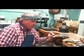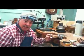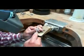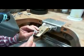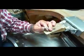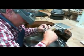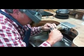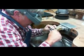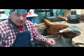Alright, now that our prongs are pushed over the diamond and holding it tightly in place, we have to do our final filing and polishing on the ring. First thing I'll do is file the prongs smooth, again leaving plenty of metal over the stone and making it smooth enough that it won't catch on anything. Then I'll use a rubber wheel to smooth it down even more. Now we're ready to take our ring into the polishing room and put the final polish on it.